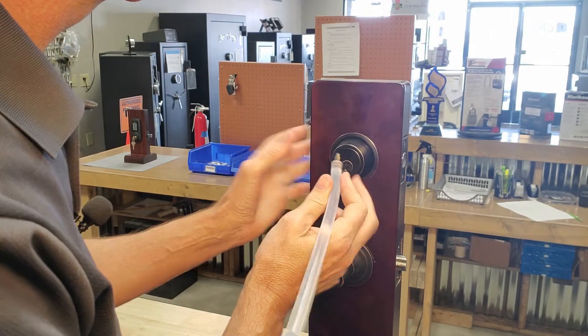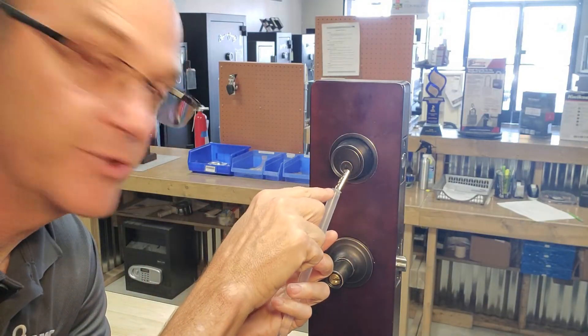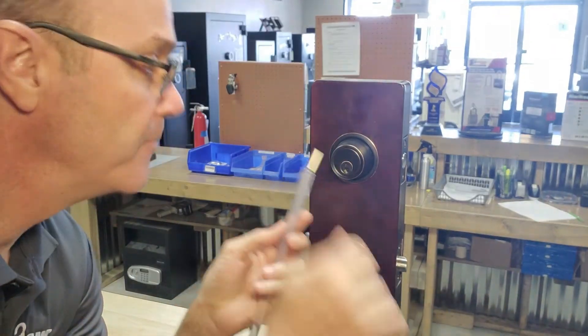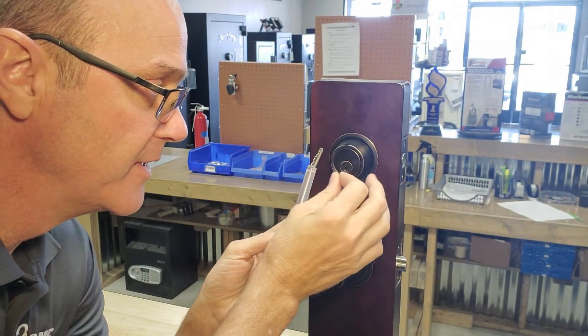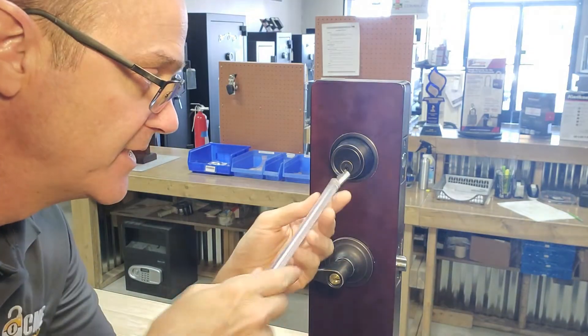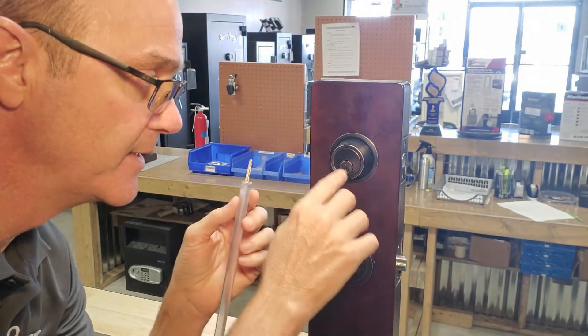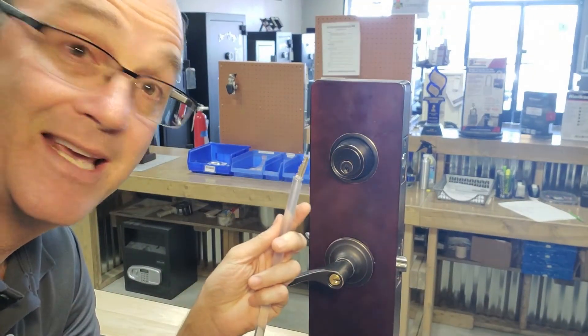Okay, look at that — there it is. You've got to be really gentle with it. This will just break off because there's just a tiny bit of glue on that key. Most of the glue comes around the edge of the cylinder, so you've got to remove it really, really gently. What I did there is I pried it to the left and to the right — you probably saw me wiggling it. That broke the glue from the cylinder without breaking the glue in the middle on the key, and I was able to get the key out.